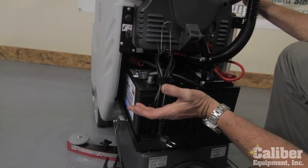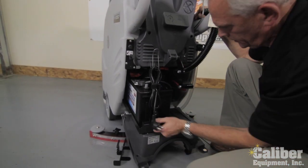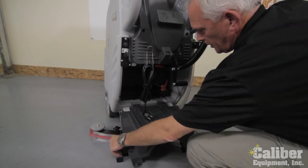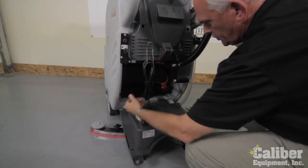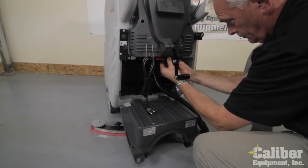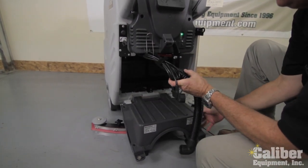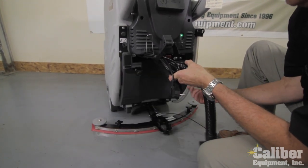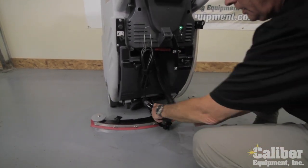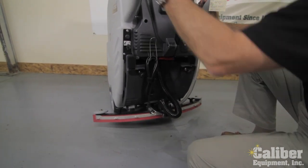From routine maintenance or changing the batteries, they've designed this for simple, easy operation as well as maintenance. They just slide back up in there, put the stop back underneath for safety, then reconnect the power cord. No latches, no hinges to break — they've got magnets, locks back very simply. Then reconnect the squeegee arm as well as the hose, and raise it back up.